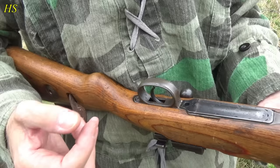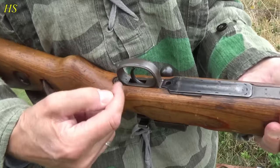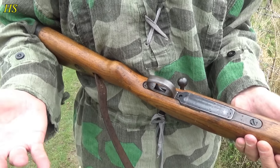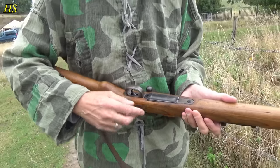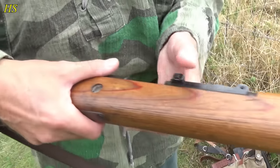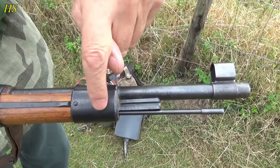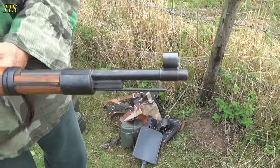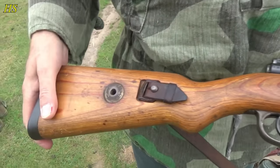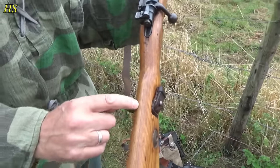You can see the trigger guard is like two layers put together. The old one was like machined — a piece of steel they would cut out the round part. But this is like stampings, like the Sturmgewehr — much faster in production. The cover here is also very thin, another part where you can see it's a late one. This one is closed completely, whereas the early ones have openings. Also machined on the early ones.